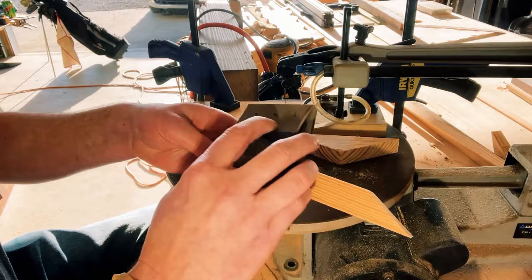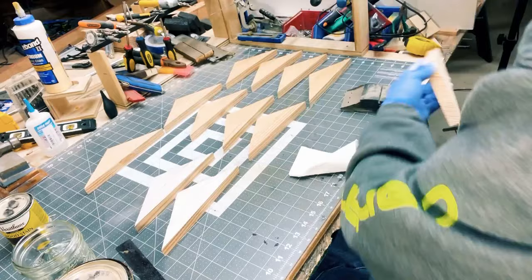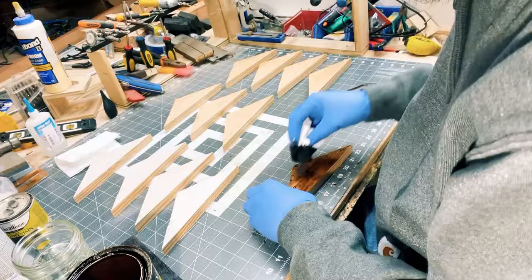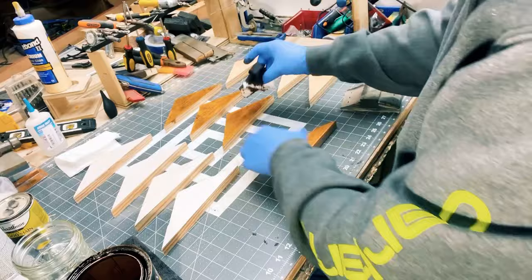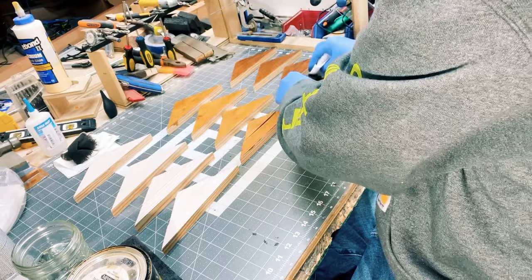Here I've just laid my triangles out. Now we have 24 pieces, laid out into sections. We're going to need four sections of a light color — I'm using spray paint and actually just wiping some of that off. Four sections of a mid-tan color, using a lighter stain for that. And we'll also need four sections that will be a dark color. When I say section, it's actually the triangle split in half.